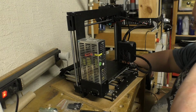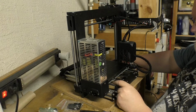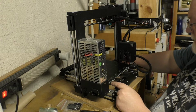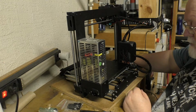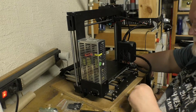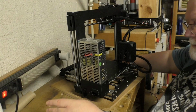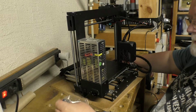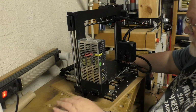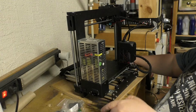The other thing I haven't been happy with on this is the noise that the regular linear bearings make. They really rattle like something is loose, but I've checked everything. There's nothing loose, so it can only be the balls in these linear bearings. So I have some Igus bearings, and I'm going to put those on, because I put those on my Mark II right in the beginning, and it's been stellar. I mean, no problems, and that's at least 2 years of service at this point.